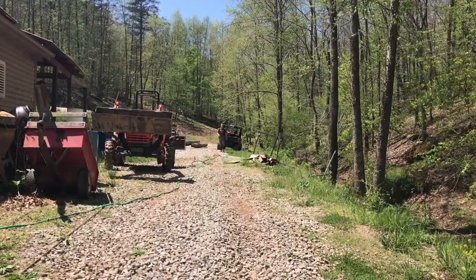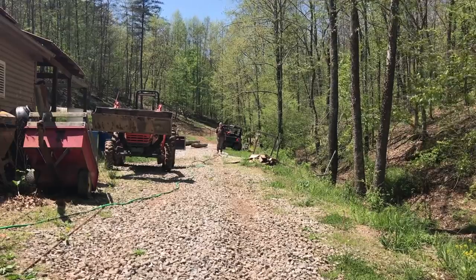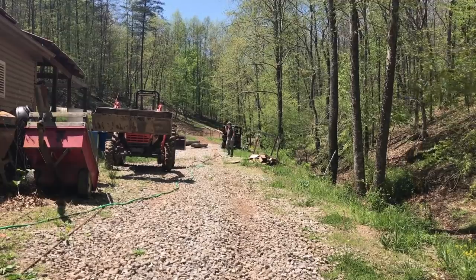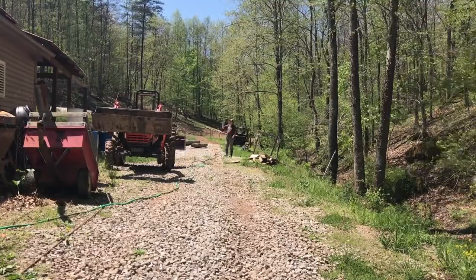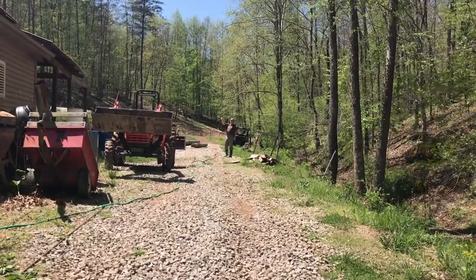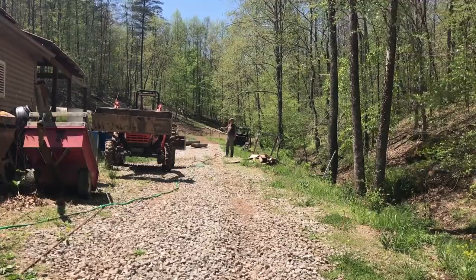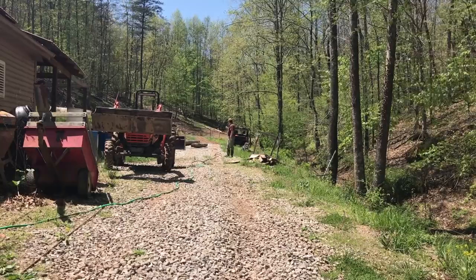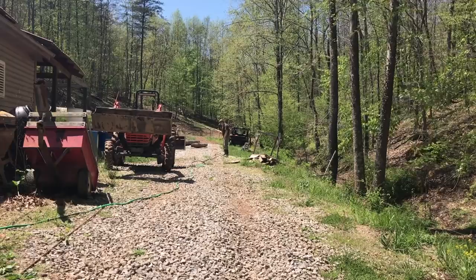Well, the plan, this is kind of plan C. Plan A was to get our well casing. I've got a 50-foot deep well right at the end of the sawmill, and I just obviously haven't hooked up a pump to that yet. Plan B, put gutter systems on the barn, have an IBC tote elevated, so that way it fills up 250, 275 gallons of water, and then be able to feed a hose there. Well, what we're going to try to do is siphon from the 55-gallon drum with our pressure sprayer. I'm hoping the pressure sprayer will produce enough siphon that it'll get us going there.